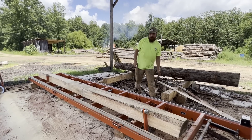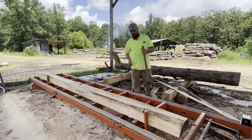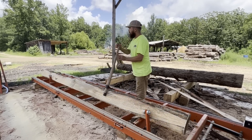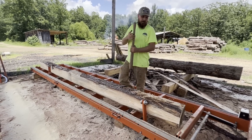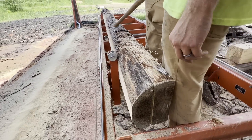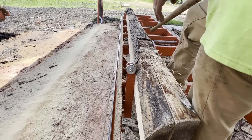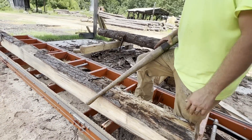Now I have two three-and-a-half-inch cants with a flat bottom - three-sided cants. What I want to do is turn these up. If you come right here and look at these boards, you'll notice as you gander down through here - you've got the same size board, we split it right down the middle. That's three-and-a-half and that's three-and-a-half. So if we want to make nominal two-by-four strips out of these, all we need to do now is find a point.